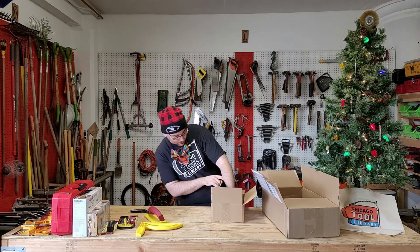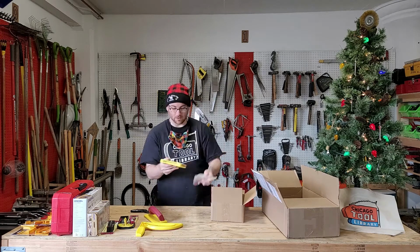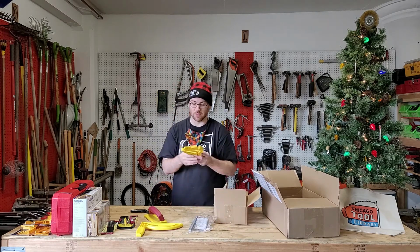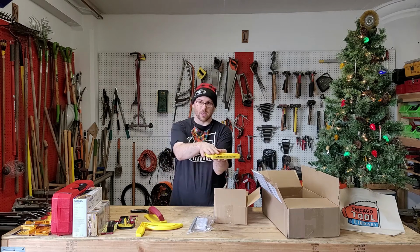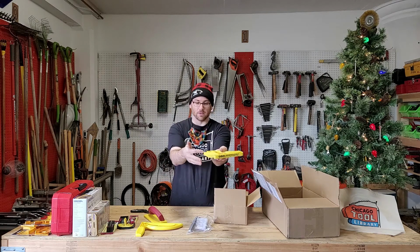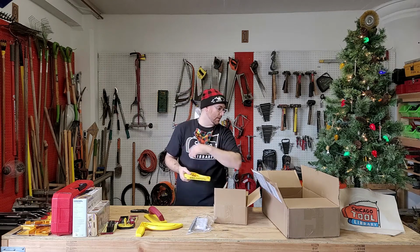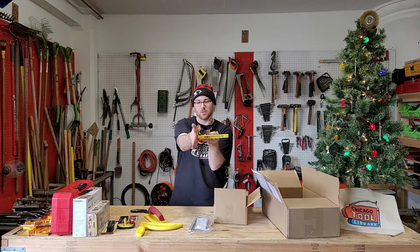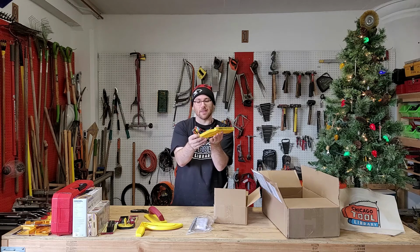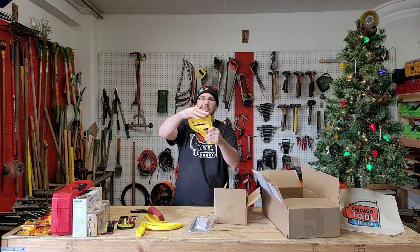And then the last piece here is a featherboard. A featherboard is a great tool for table saws. What it lets you do is mount this to the table saw and hold it flat, and these feathers hold the piece against your fence. So if your fence is here, and your blade is right here, it applies pressure to the fence to keep it straight and keep it there. It's got this design where it'll let the wood go this way really easily, but it won't kick it back.